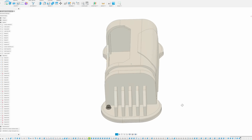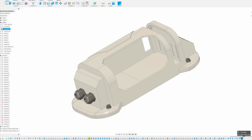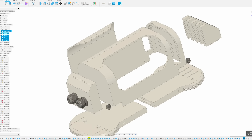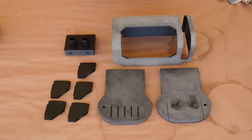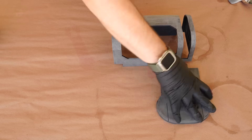Something I really like when I buy models is that they come in a bunch of pieces, and even better when they have some kind of slot and pin or snap-together design — and this design has both. One for ease of printing and sanding with minimal supports, and two to help with alignment during glue-up. I printed all of the parts in ABS filament at a .20 layer height since there weren't any real details to capture, plus a taller layer height makes for faster prints.